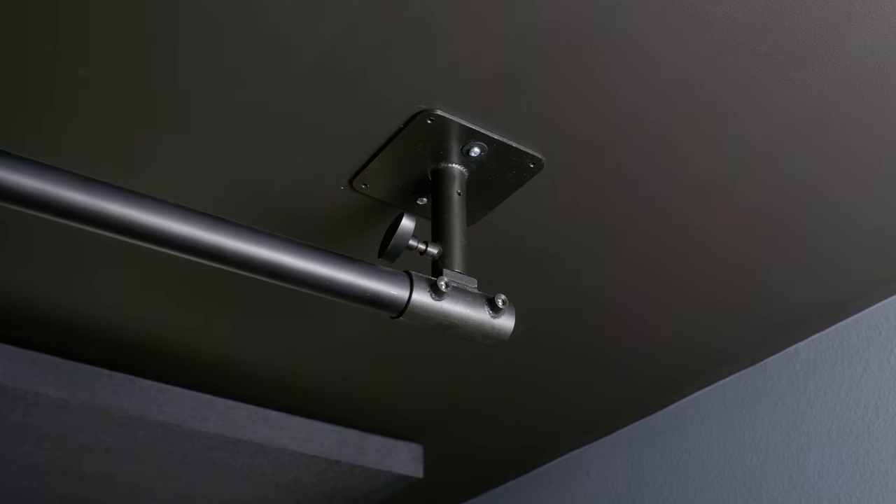This called for heading into the attic. Make sure to wear protective gear and some kind of mask to protect your lungs — I didn't do any of those things and paid for it later. What you'll need is a 2x6 that you nail between your studs; then your junior receiver can be securely screwed to it and not your drywall. If I could do it all over again, you might as well go with a 2x10 so you have more room for alignment. If you don't have attic access and still want to keep things off the floor, you're going to have to use the studs in the walls. Find the stud, mount your 2x10 over the drywall, and then mount your setup to the 2x10. There are many ways to get the same results — if you have an apartment, you just have to patch some screw holes. Having the rail system gives me the ability to mount multiple lights and future-proof the setup as well.